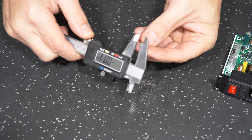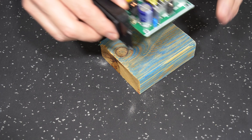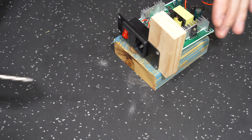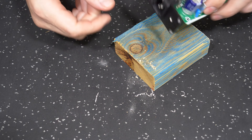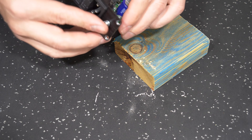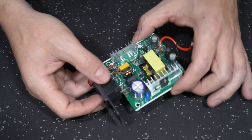The screw we're going to use looks like an M4, yes M4, so we need a four millimetre drill bit and then we've got a home for this. Bringing in our wooden block to get things off the bench, we'll find our mark and drill our four mil hole. That's fairly straightforward - we've got the hole and our screw fits there nicely. For a bit of cleanup, just be wary we haven't got any stray swarf or aluminium swarf throughout our circuit. This looks clean - tap it out just to be sure and we're good to go.